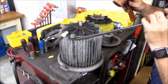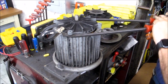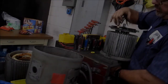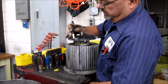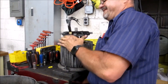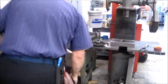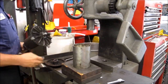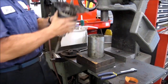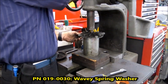It takes some manipulating — this one is being more difficult. There we go. Pop this cap off here. This part did not come off as normal, but that's all right, not a big deal. If you've got a puller you'd be using a puller; we have a fixture. Put it on our fixture, put it in the press, and pop it right off.